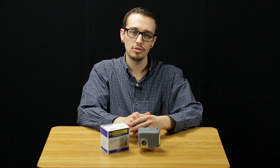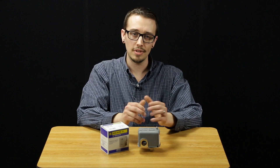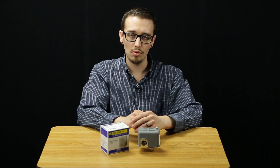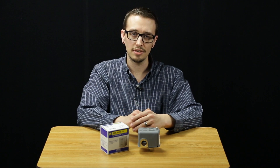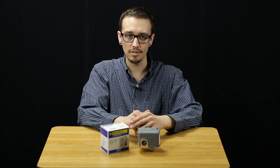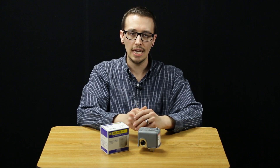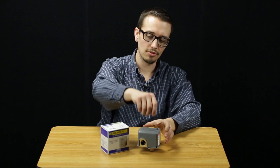Most switches are set with a 20-pound differential. The switch works by sensing the pressure in your system and activating or deactivating the set of contacts inside the switch, depending on the amount of pressure in the system. I'll take the lid off of this switch here and show you exactly what's going on internally.